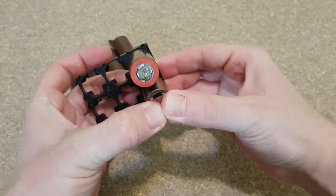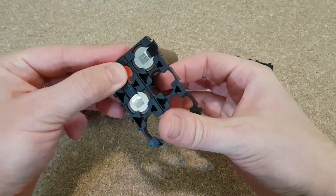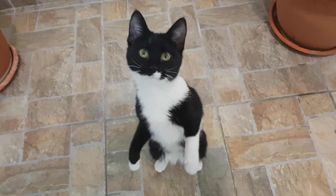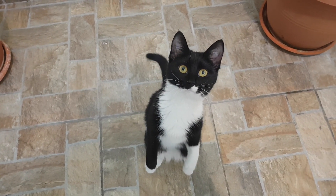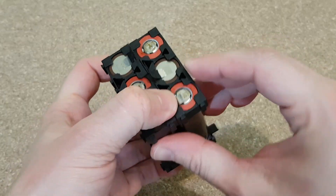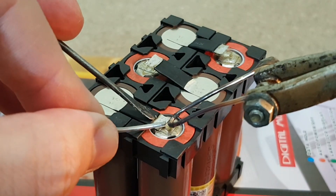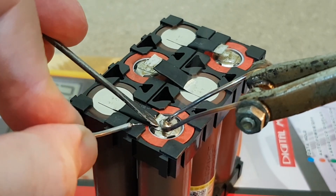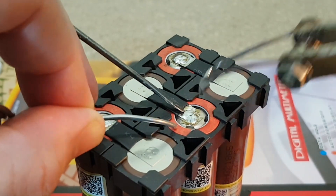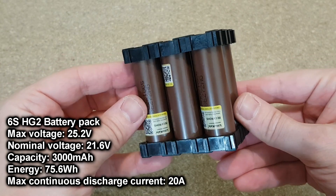The positive terminal of each cell will be connected to the negative terminal of the next cell. But be careful not to cut your fingers on the nickel strips — they are almost as sharp as my cat's claws. After mounting the cells on the bottom holder, I need to carefully place the top holder. I will solder the nickel strips with my old and trusty soldering gun — not because it's ugly, but because it's very powerful and I want to solder fast so the heat will not reach the lithium cells. This battery pack with nice soldering joints can output maximum 25.2 volts.